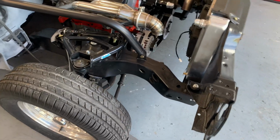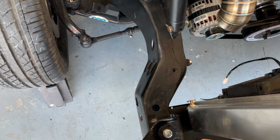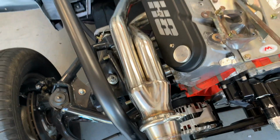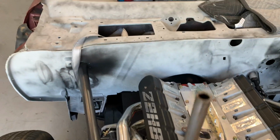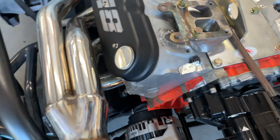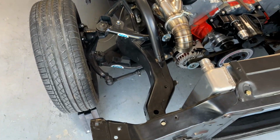Other than that, once we get this welded rod up on the subframe, we can start heating it up, bend it up, and tap it, because this is a 3/8 inch inner diameter rod. So we have 3/8 to tap, so we can tap that and run a bolt straight through it. And that'll be one side of our mount. The other side we'll figure out after we get the hot side done. But until then, we need to probably throw a fender on here and get the turbo somehow, some way mounted up.